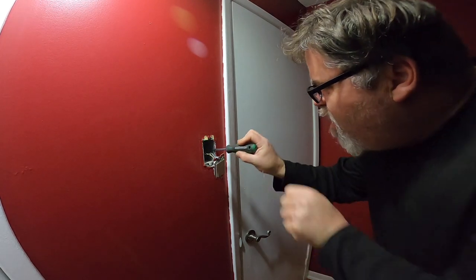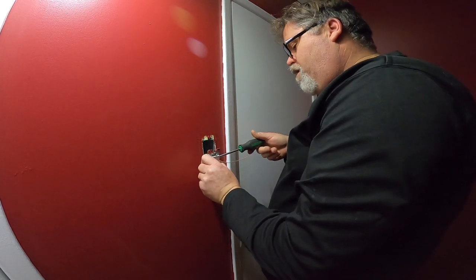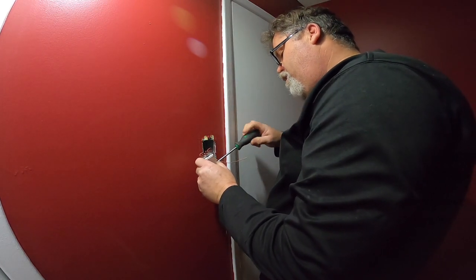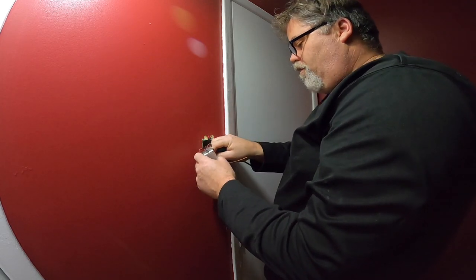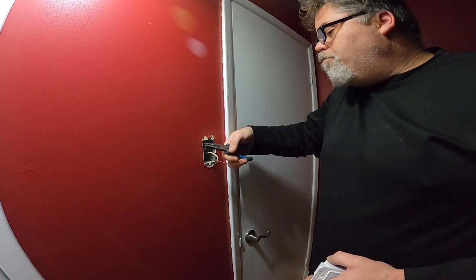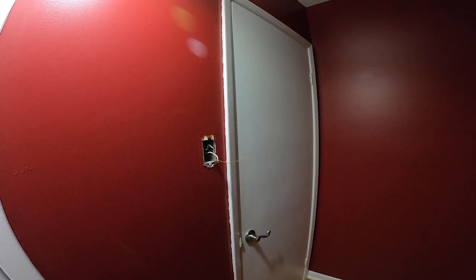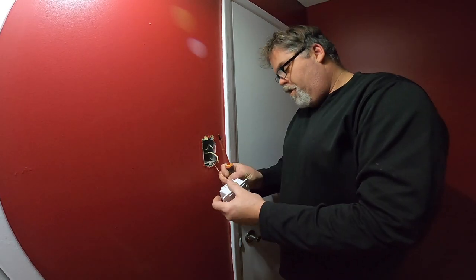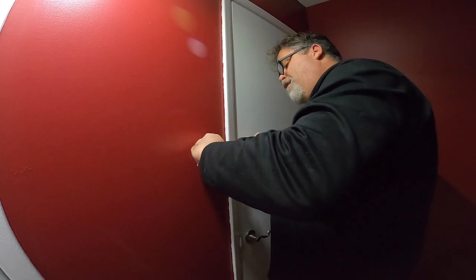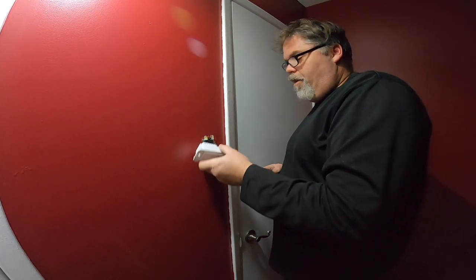So we're going to put another ground on here, so one will be load and one won't be. I'm thinking this one here will be the load side and this one here will be the trigger side. White is load. White's supposed to be common in most households, but for some reason my household's all cocked over. I think it's because my fan will run with the light switch off, which is why I have no common down here. I think it's just a trigger.